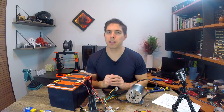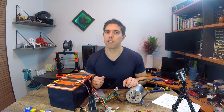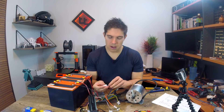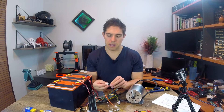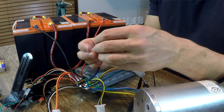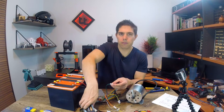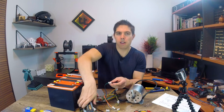There's actually one more thing you don't have to wire up but really really want to — the speed control. On eBay it was advertised as two speeds but it actually has three, and I might have missed this without watching YouTube videos. We find the wire called stall speed — it is blue, black, and green. It works similarly to the forward/reverse control, with black as ground and blue and green as high and low speed. Leaving it disconnected is medium speed. Connecting black to green gives high speed, black to blue gives low speed, and disconnected is medium speed. You could easily be stuck on medium speed and waste a lot of the system's power.